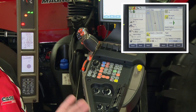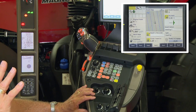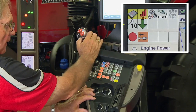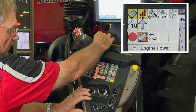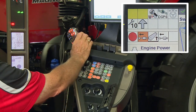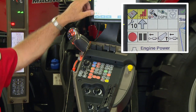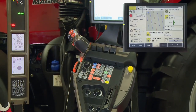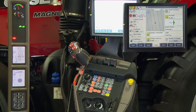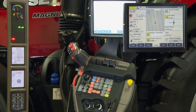I've got to think to myself — I can do it either dynamically or statically. So when I get to the headland, maybe the first thing I'm going to do is raise this implement, then raise my hitch, then raise this unit. When everything gets up, I'm going to hit the step switch. By hitting the step switch, I place a pause in the unit, allowing me to make up time. I could do everything in one complete turn, but this way I've got some time lapse so I can adjust my sequence.